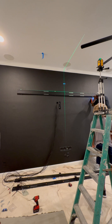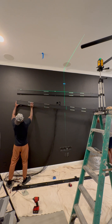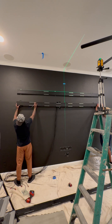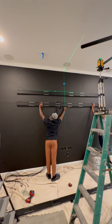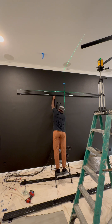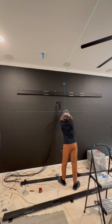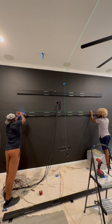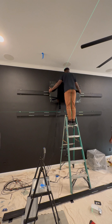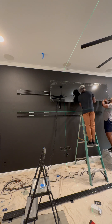Don't forget it's our first time using something like this, so it's all trial and error. What we did with these next two is put them on the wall, made sure we slid the little middle bracket against the stud, and then tightened that up. Even if you don't want to hire me, the instructions are very easy — from the bottom hole to the top hole is 21.6 inches exactly, so it's really tough to mess up the measurements. Don't forget: 21.6 between each row.